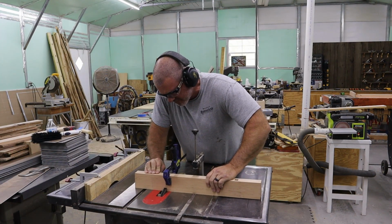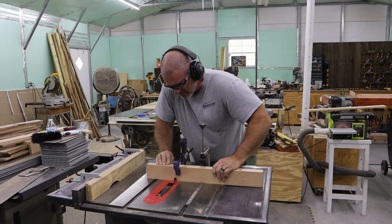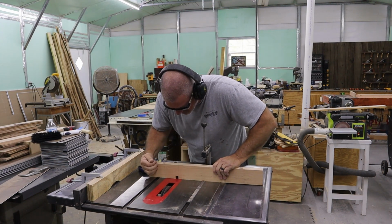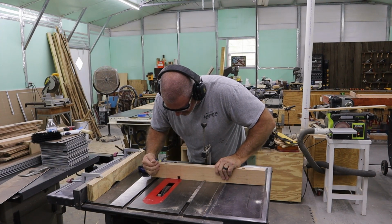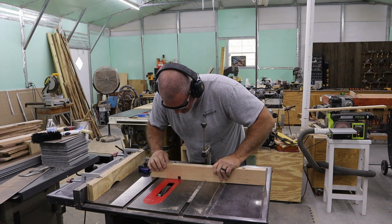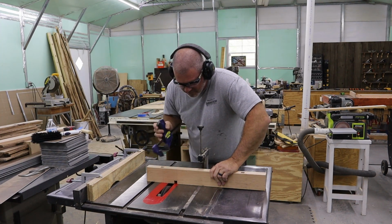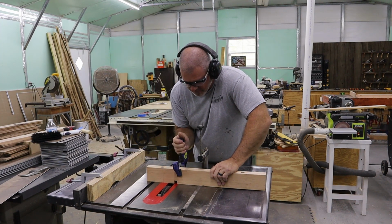The two side boards will be mirror images of each other. On the back side of each board, a 3 5/8 inch deep slot will be cut above the bottom shelf and below the second shelf to place the back supports. It will make sense in a minute.